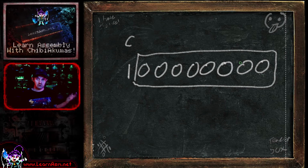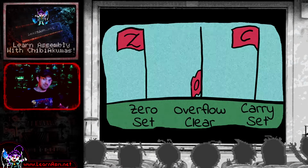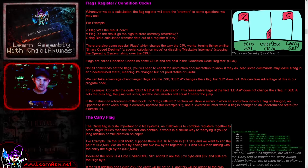It's when you're doing rotation and bits are pushed out of the byte or the word, depending on the command you're using. Now, as I say, I know this is going to be a little bit confusing, and you don't need to worry about it if you don't understand it at this point, because all of this will come back later on when you're actually looking at the processor you're interested in and the commands. But at the moment, I'm just making the point that the carry has multiple functions, and it's to do with data that has been pushed out of other registers as a result of calculations. So I just wanted to give you some background there. That's why we're covering that. So don't worry about it if it's too complex for you at this stage.